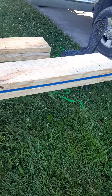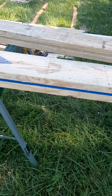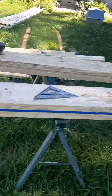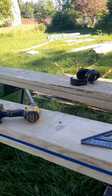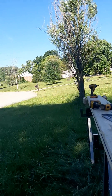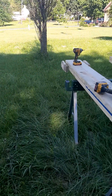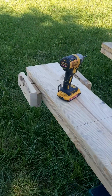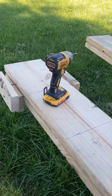What I'm doing is taking these two boards and screwing them together to make a beam. I've got a piece of OSB in the middle that I've got glued off and I'm screwing it down so that it'll be straight along the bottom edge, so that when I set it on a beam, at least one side will be straight and true. Getting the two boards to line up — because they might have different crowning or different places where they're not straight — can be difficult.